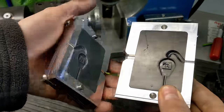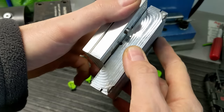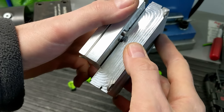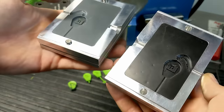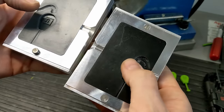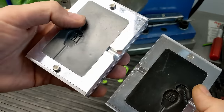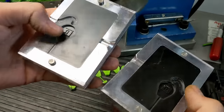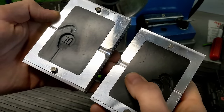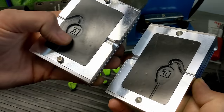It's a fun experiment to see what happened. The crazy thing is these molds are actually remarkably flat — they achieved extremely flat tolerances. We're having almost no flash other than what's coming from the bad mold material and imperfections of the resin print. This side is injecting perfectly. So we'll go back, revise a little bit, and do the mold half the correct way with high-temp resin to see if we can get a part that actually functions properly.